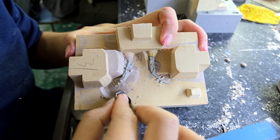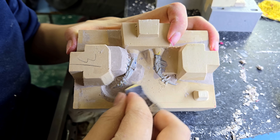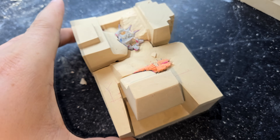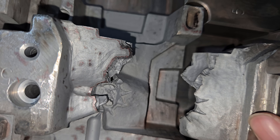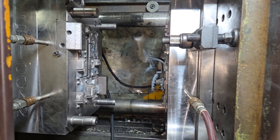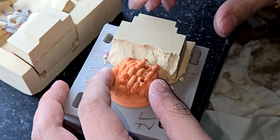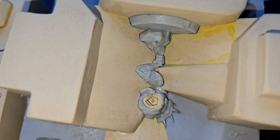The interface with the resin production masters is carefully sculpted to get precise cavities in the clay and plaster, and to position mold joins and part lines in the best places. The molds have a top half and a bottom half, but many also have side blocks. Some mold cavities are formed by three or more metal blocks — the two biggest demold along one axis, but the side blocks demold at a 90 degree angle. This allows for model shapes that would be impossible to cast with a simpler two-part mold.